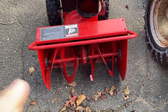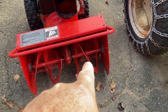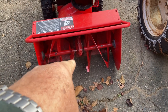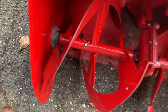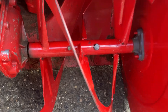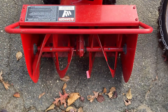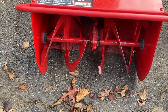I'm hoping he didn't damage it — it seems like it's working okay. But with that grade eight bolt in there, if he got something stuck in there, he's going to destroy that bronze gear. Always use the shear pins that are supposed to come with it. Don't use grade five or grade eight bolts — you will strip out that bronze worm gear, and that's not cheap to fix.